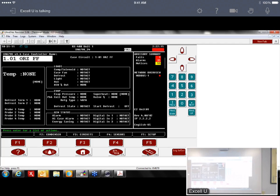If it's at 9600, it's going to say 96. So hit the up button, it goes to 19.2, and then hit the set button, and then you're good. And then if you just walk away from this, it'll exit the programming mode in 15-20 seconds. Or if you wanted to, you can hit the set up, and it automatically exits. But anyway, just walking away, it will reset itself.